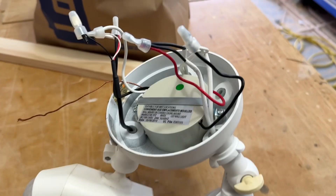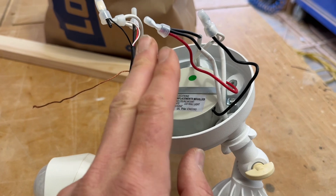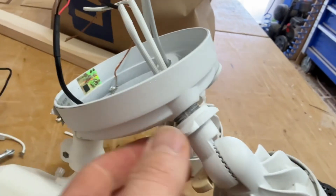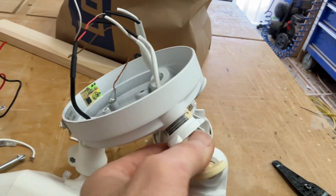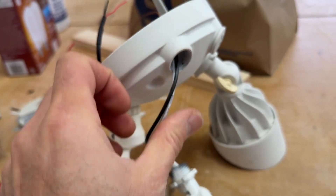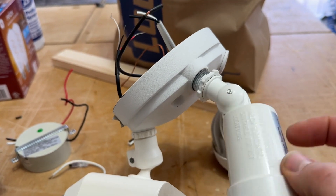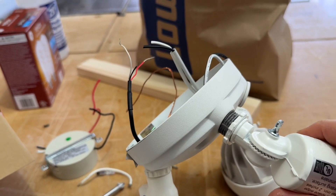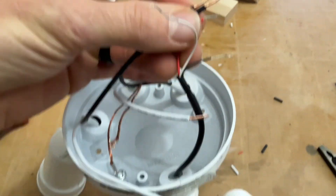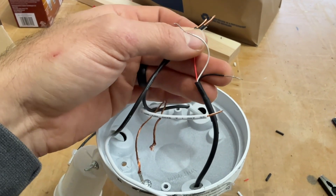It's not the right amount of power, so we're going to bypass that. In fact, this may be the only problem — it may not actually be the lights. But I don't want to have to keep dealing with replacing this over and over again. Going with these screw-in bulbs, all we have to do is replace bulbs that are a lot easier to work with. Okay, I got these clipped and stripped. I unlocked the lock nut and I'm going to unscrew this from the base. These new lights, if I'm lucky, will match up with the threads — I'm pretty sure they will. Let's give it a try. Feed those through there. It looks like a match — yep, it's a match. Awesome. Okay, I have the hot leads here with the red, which is basically the switched on and off coming from the housing here with the motion sensor. I'm going to tie those together, and then the remaining leads will get tied directly to the house.